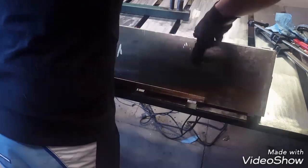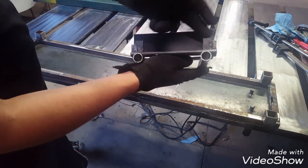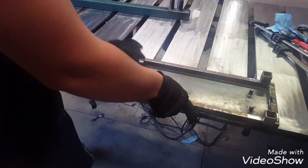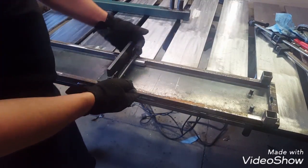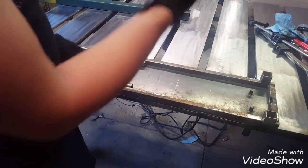Now if I take this bender out and flip it around, it lines up like that and slides into place with that bar. And I've got this guy that'll hold a flat piece of flat stock for a mounting bracket. I just load it in here and I can slide it to the length that I need — it's nice and tight. Then I'll put my hairpin leg in here and that'll put it at the right angle. I'll set my distance, clamp this down, and that'll give me the right distance to weld these guys on, and then I can remove it from there.